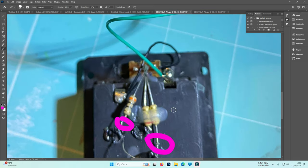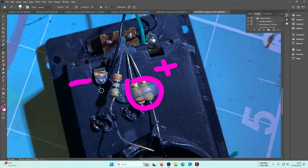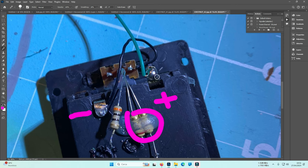But those two resistors there were intended for the white and blue colors. This one is intended for yellow and green colors. Okay, maybe also red, but I don't think it is powerful enough to prevent the red LED from exploding, no, but to break down. Okay? You had to experiment, Susan, but in this case, desolder and resolder.